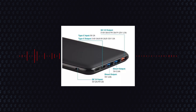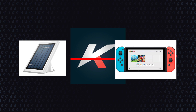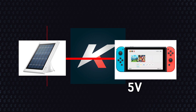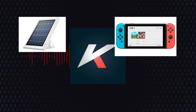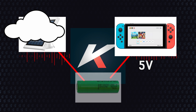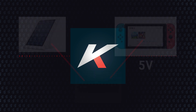Most power banks output a current of 5V at 1A. I could simply get a solar panel and connect it to a USB circuit to make sure it would output these 5 volts needed for the console. However, the power output of the solar panel will change as clouds go by or when you don't have enough sunlight available, and I think this would be bad for your Switch, since we're talking about a console with an internal battery. So in order to have a stable current, we'll need a circuit with a battery. This would be good for two reasons: it will provide a stable current, and the battery will store at least some power for you to charge your system for a while after the sun is set.